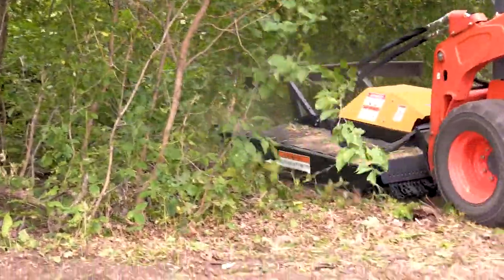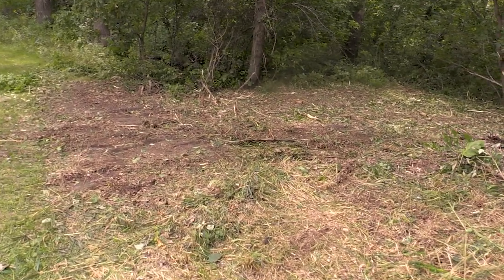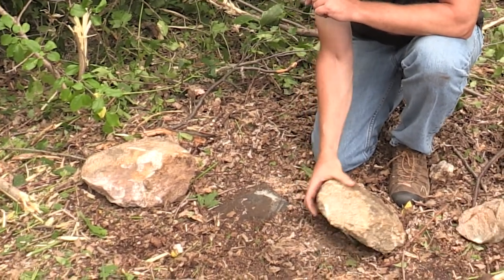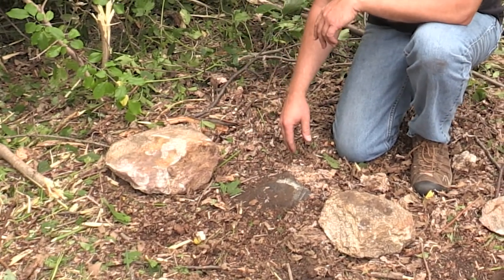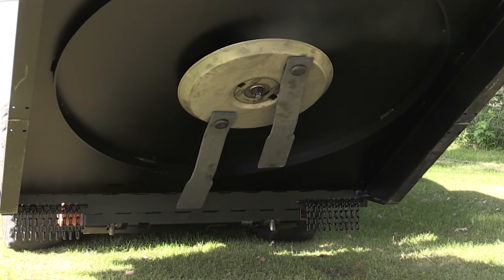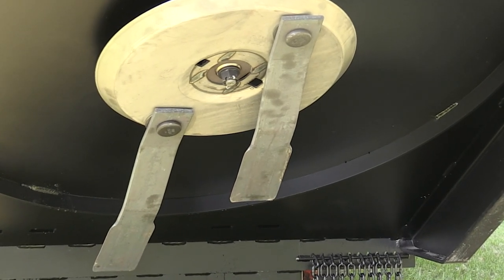One of the surprises you find when mowing are rocks. Just mowing around this dead tree I've already hit four rocks — not uncommon here because a lot of this land used to be pasture or farmland and people would throw rocks by the trees. These appear to be granite; I've actually shattered a whole chunk off one rock, taken a complete side off another, and scuffed the top off others. This is why it's important to have blades heat-treated to a safety standard — so they don't shatter. You'll get gouges and dings, sometimes a slight bend, but they stay together so they don't become projectiles. That ductility balance — strong, hard, but not brittle — is exactly why you don't want cheap blades on brush cutters.